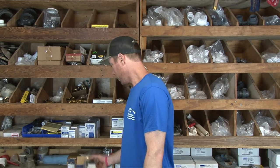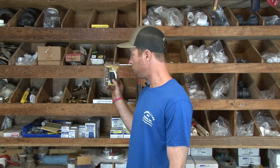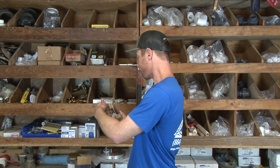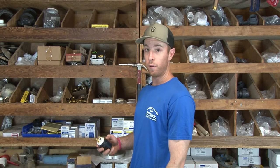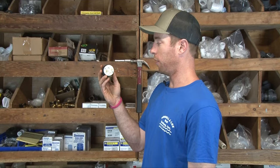What we've got here is our typical plug — 30 amp, 230 volt plug that you can buy at Lowe's, Home Depot, or any electrical store. Most of the well pumps that we put in are half horsepower and above, so they're 230 volts. This is a typical plug that goes into a 30 amp, 230 volt circuit on a generator.